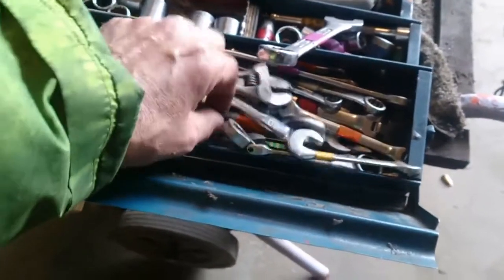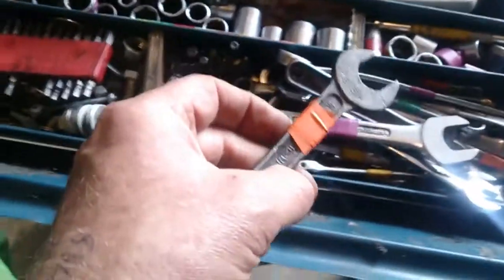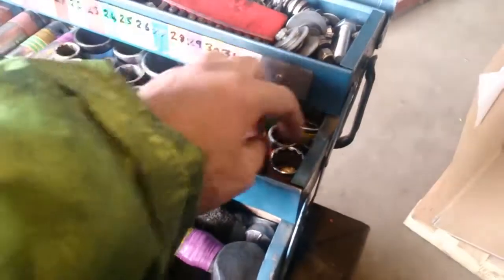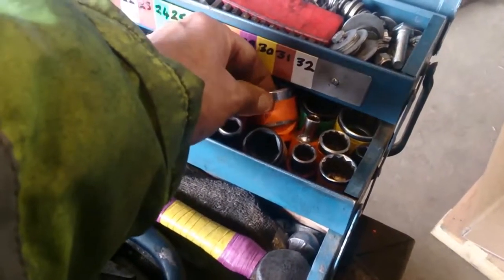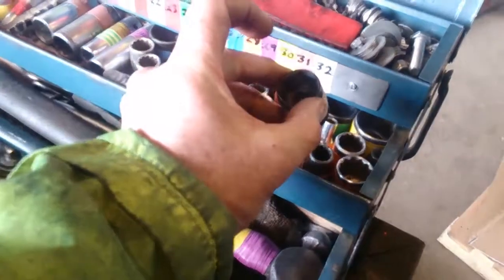Here you go — spanners in here, all these to identify. Now I've got the color code system going: that's 19, that's 10, that's an old spanner — got the equivalent of an 18, I think it's actually a Whitworth spanner. And then you've got your sockets here. In amongst these: orange — that's got to be an 8, that's got to be an 18; brown — that's got to be 21; big orange one here, that's 28; and this is going to be 22.